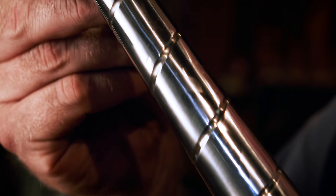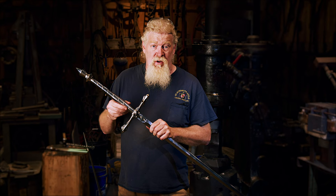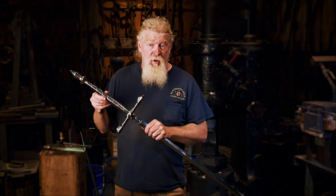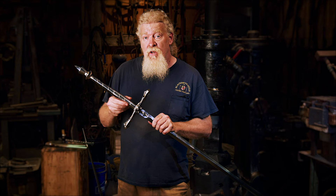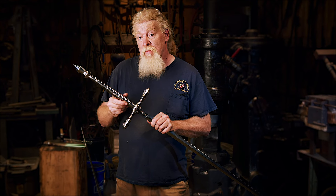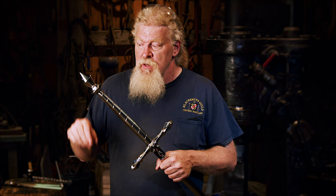This is a forged piece of pipe. Initially our intention was to hot-forge it or put some wood on the inside and forge it, but it turned out it was easier to create this form by just hammering it cold. Ilya does that on the Iron Kiss power hammer. We usually core them so they've got a core inside and aren't just hollow.